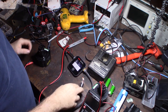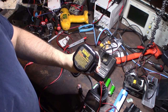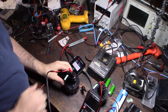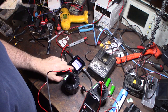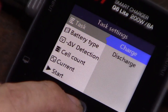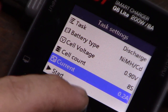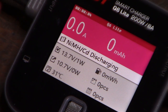Now I have one battery using the old-school discharger method. I'm going to use a more high-tech version for the other. This is a 9.6 volt battery and the typical NiCad cell voltage is around 1.2 volts, so dividing 9.6 by 1.2 gives about eight cells. I set the negative and positive leads, and I just charged this battery — it shows 10.7 volts. Going to discharge mode on NiCad, setting eight cells, and doing a 0.2 amp discharge.